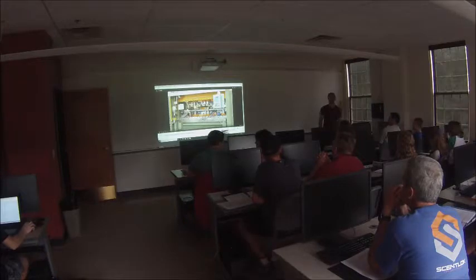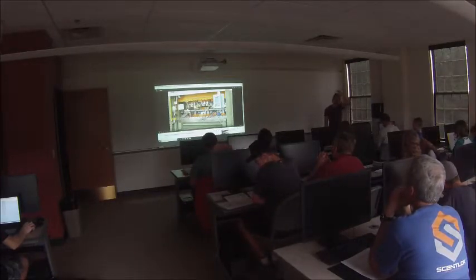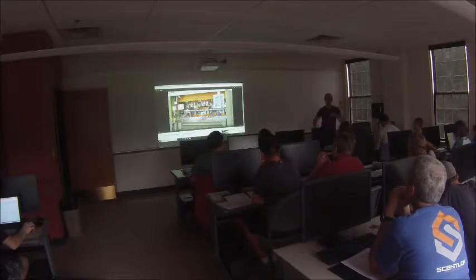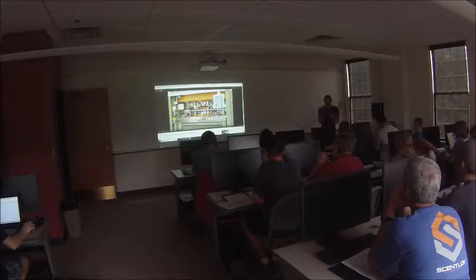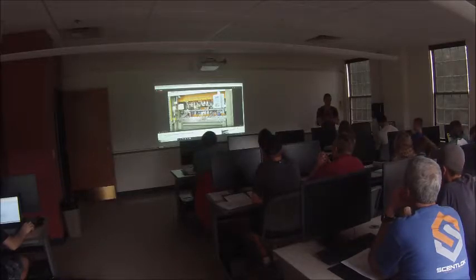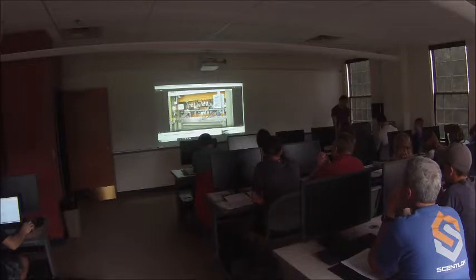Okay, so that's EDM. EDM's cool. We don't use EDM, but it's used in the tool and die making industry because it's really, really precise. You can use hardened materials, and EDM doesn't mess with the hardening because the spark only removes a little bit of material at a time and doesn't heat the surrounding material, which is the problem with laser and plasma. Obviously you don't have a handheld EDM because it's so slow.